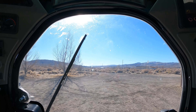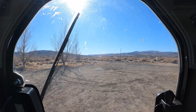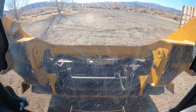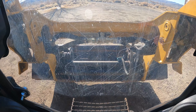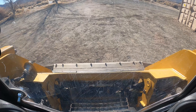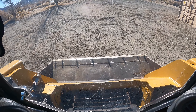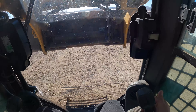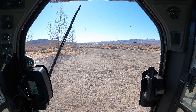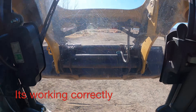I'm assuming it's great for like forklift - like if you have forks on the end. But what I don't understand - I don't know if this is normal - on the way down it's not auto leveling. Like see, the bucket's not level anymore. I don't know if there's a problem or if it only auto levels on the way up. Like let's say we just curled that - see there it goes like immediately - I'm just lifting it like I normally would lift it. We either fixed it or we've got a problem going on the down. I'm going to have to research that.